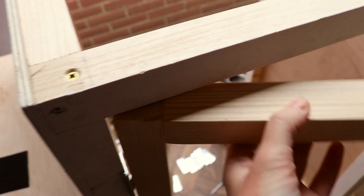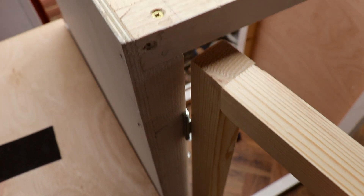We already had the structure made for the sink, so all we had to do first was cut the battens to size after measuring the inside of the structure. Then over the top of that we laid the tongue and groove cladding and marked off with a pencil where to cut. We cut it and then just screwed it on. We also added another piece of batten through the middle for extra support and also something we can put hooks onto to hang things on.